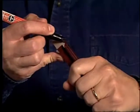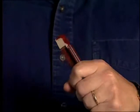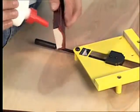Before we join the corners, here's an important tip to assure professional results: mark the edge of each miter cut with a light colored stain marker to blend any seams that may show once joined. Stain pen sets can be found at most art supply, craft, and hardware stores. It really makes a difference in your finished frame.